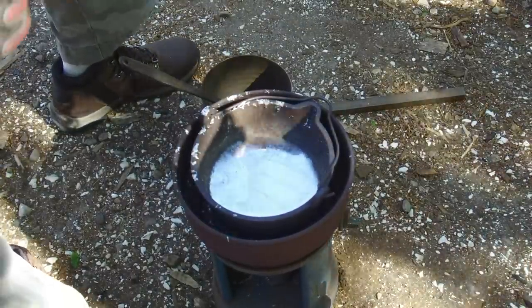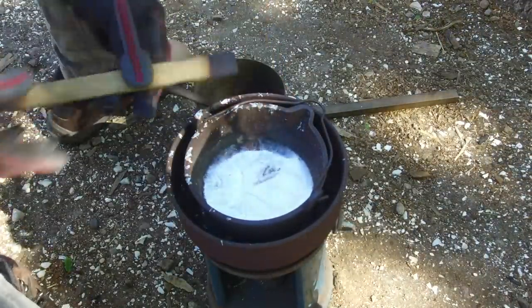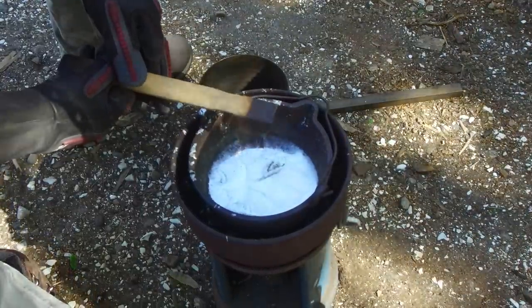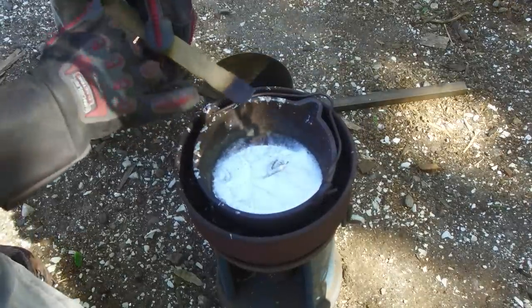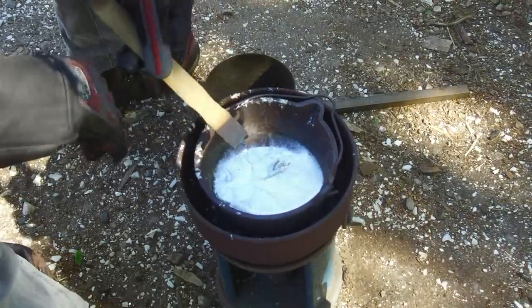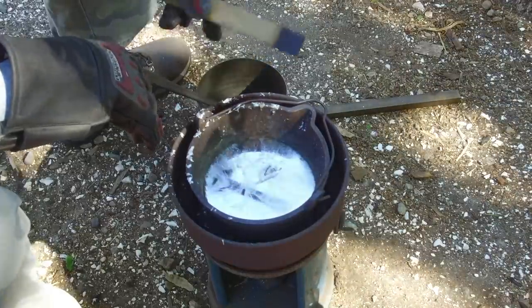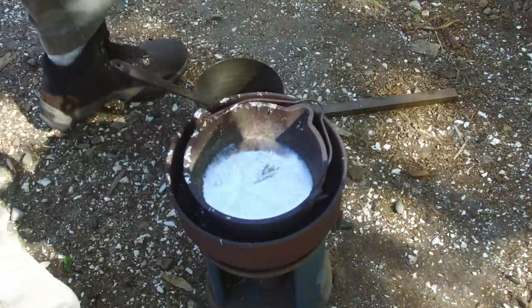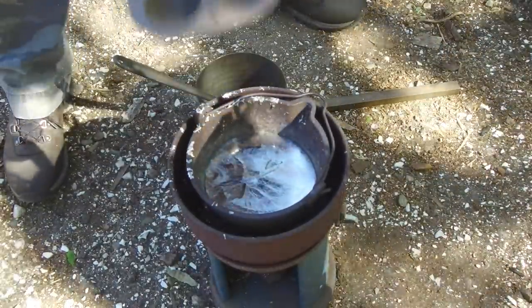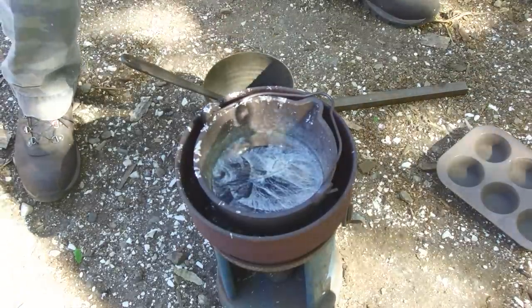That's the depth of our material in the pot — a good gauge of the amount of material we took out of there. We probably want to be a little bit deeper; this is about one-third pot, and we'll probably want two-thirds pot so that we have plenty of material to pour that one big half. We're going to go ahead and pour this into our cupcake pan here, and then we'll have little ingots that are much easier to bring back and melt in.